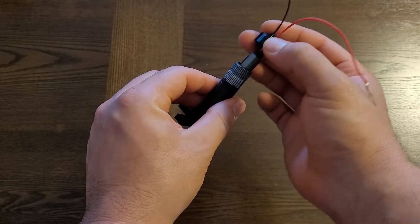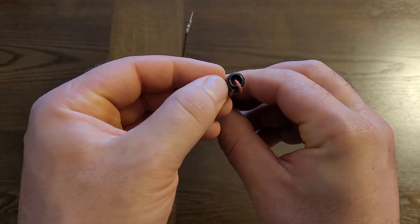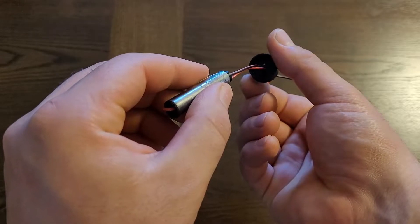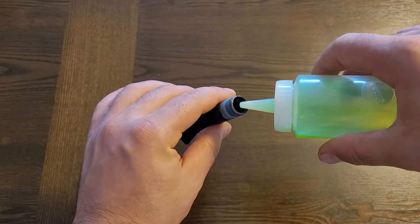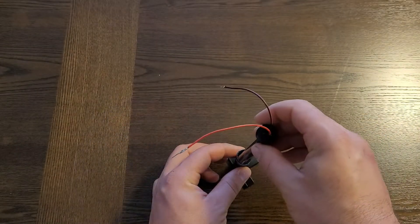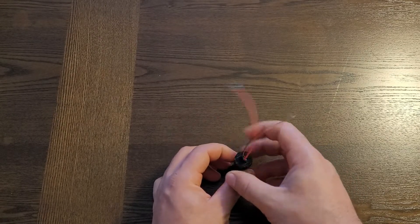To that end, I've made another variation of my battery cell. This style is cylindrical in shape. The aluminum and graphite are rolled onto a spacer, one on the inside and the other on the outside. I used some tape to connect the wires to the electrodes and fed those wires through a cap. The idea is that this spacer with the battery electrodes attached will be inserted into the cylinder, which will be filled with electrolyte, effectively isolating them from any air. In addition to my new cell, I will still be using my card style cell, battery test box, and test LED, all introduced in part one.